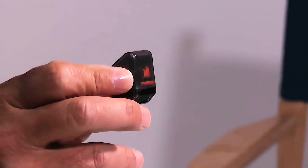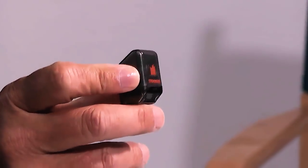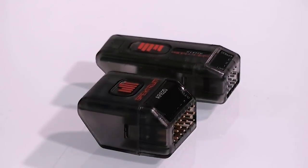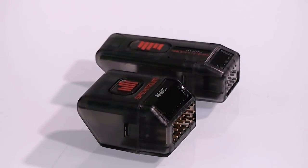One of the things you'll notice right off the bat is there's no external antenna. We've incorporated an onboard antenna — several months ago we developed and released a 2100 series receiver for surface and we've been testing it. The antenna was developed by Texas Instruments, and its performance is actually superseding that of our typical wire antennas. We've been testing this in aircraft applications and we're actually getting better range and better RF link performance than many of the wire antennas. Consequently, we decided to incorporate this in a four and six channel receiver.